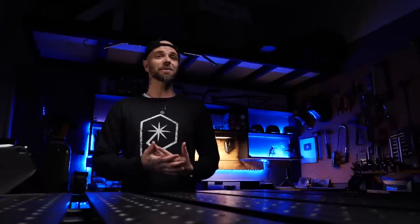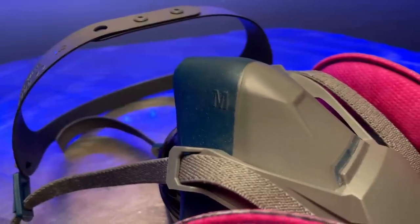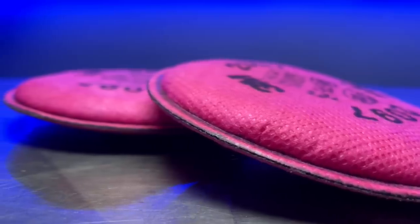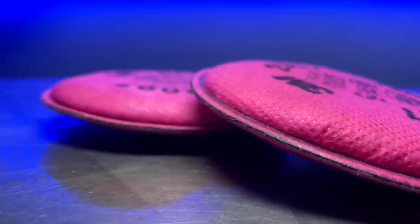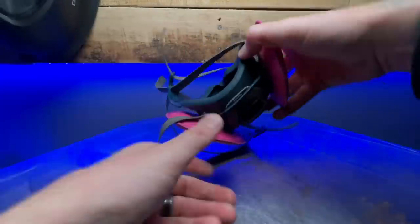Whether I'm doing any stainless steel TIG welding, you can bet I'm always rocking one of these respirators. There are tons of different versions of respirators you can get, and there are filters specific to exactly this type of welding. I absolutely recommend getting one of these and remaining paranoid about wearing it all the time. No matter what your setup is, always be sure to do the research on exactly what type of filters are appropriate for what you're doing.